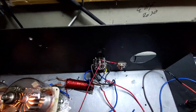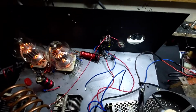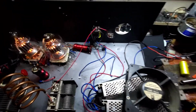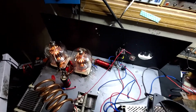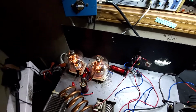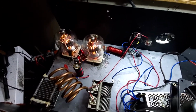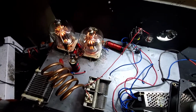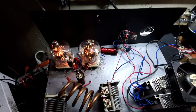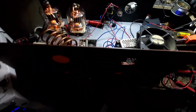We have this relay on the top. The input relay is on the bottom. The signal comes in, hits our input relay, comes out, goes straight to our input tuner and straight to the tubes. There is no running RF back and forth inside this box creating impedance and noise and whatever else goes on. And you'll notice a lot of this box is wired up with our proprietary wire that I make, twisted pairs of red. A lot of guys do that. That's for current and for stability. So here we go. There it is.